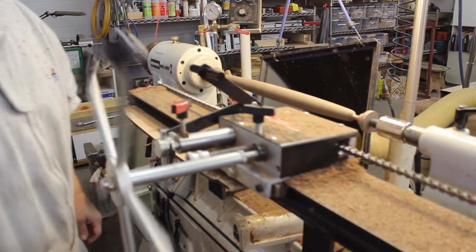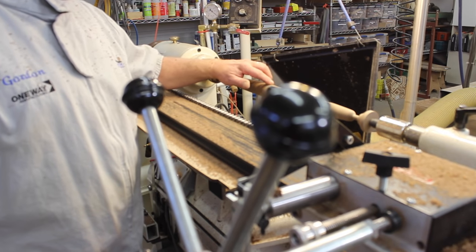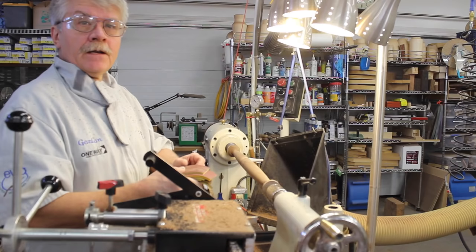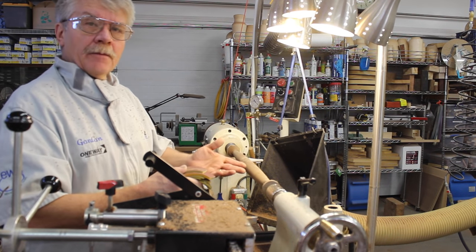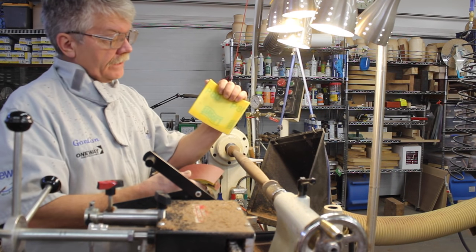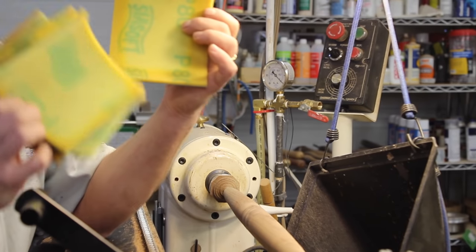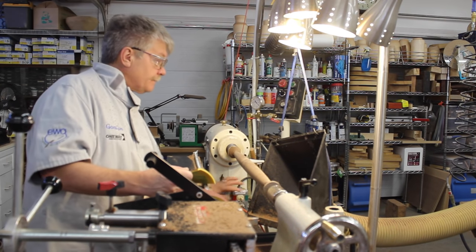The turning is done and I'm going to sanding now. You'll notice there's a little whip — that'll be handled with some 80-grit sandpaper. I'll stop the lathe for a minute and get the sanding operation going. The entire operation takes me a little over five minutes start to finish, including sanding. I use a soft foam-back sandpaper — I think it's one of the best. In the newsletter I'll explain where you can get that. I'll go through all the grits from 80 up to 220. I'll turn my lathe in reverse and put the dust collector on.